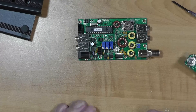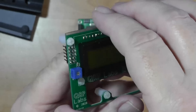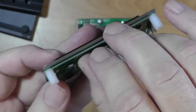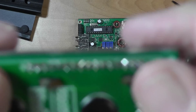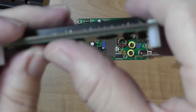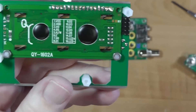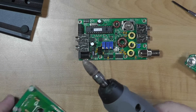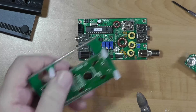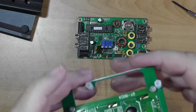The next board that's assembled is the display board — this is the display board right here. The display connects to the main PC board by putting little pieces of wire through here and soldering all 16 holes right there. Now there's a problem I ran into: when I put the two boards together, the lumps of solder were too big and they interfered with parts. So I got out my handy Dremel tool with a grinding bit and mounted this in the circuit board holder, then with both hands kept it very steady and ground those down.